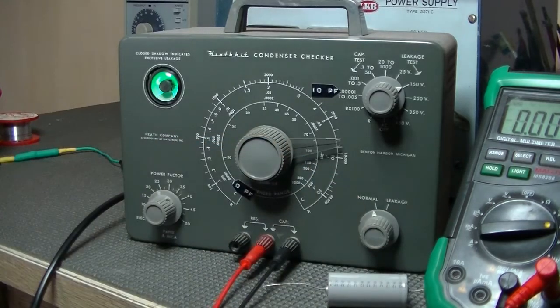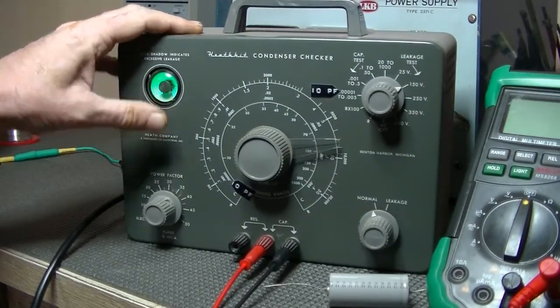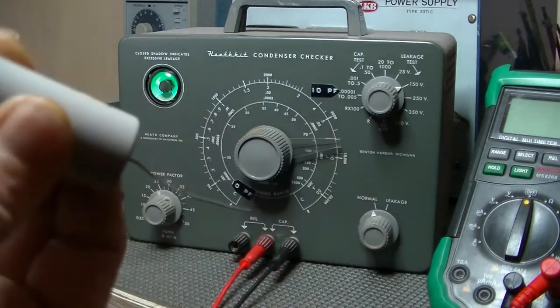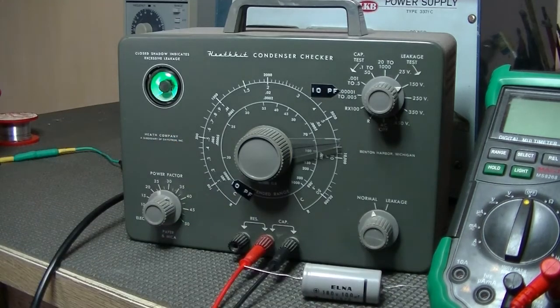The other thing I did read yesterday, and Ken also mentioned this to me, is that whichever way you're doing it, whether with a capacitor tester using a magic eye, or like I did with a power supply and a multimeter, if the DC voltage doesn't start dropping within 5 minutes, unplug the cap. It's not going to be reformed, and from what I read in that article, the voltage going through it will be dissipated as heat inside the cap. And of course, too much heat and the cap will go pop or bang or whatever. So 5 minutes for me, I would have thought personally, because like I said, I'm a scaredy cat, if it doesn't do it in a minute or two, then I would give up on that cap.